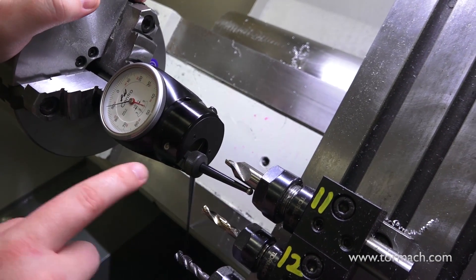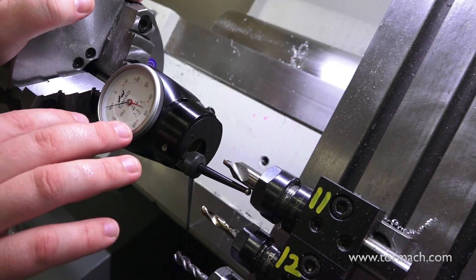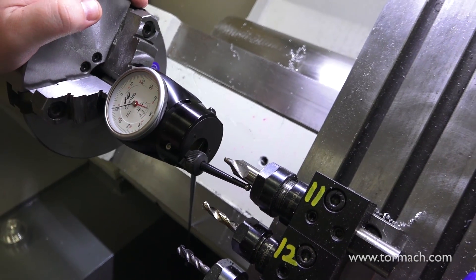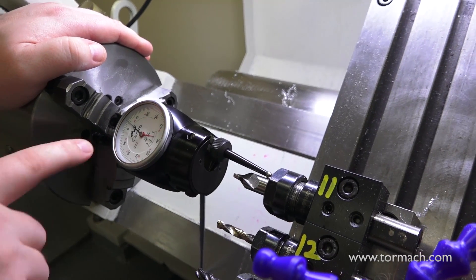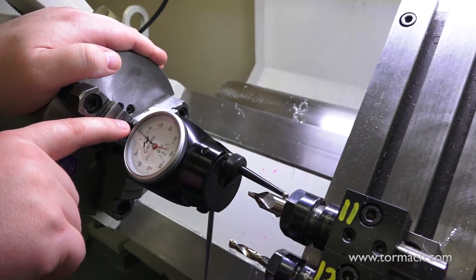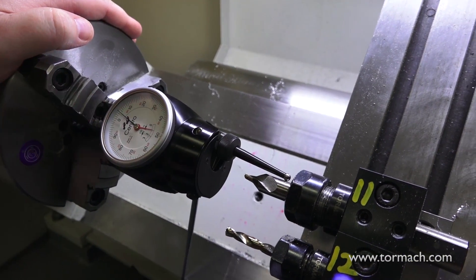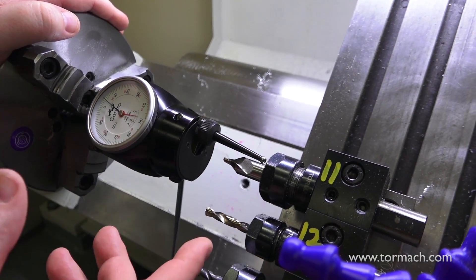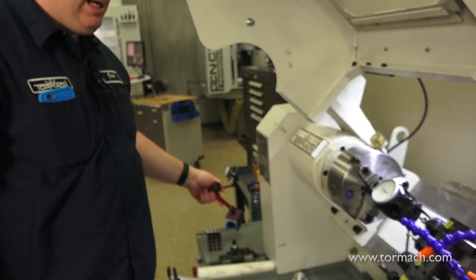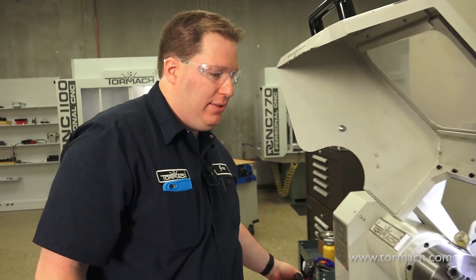As you can see, I'm on the bottom. This is in metric by the way — that is one difference, this is in metric, not inches. I am 10 microns — so 100 microns lower and 40 microns on the top. So I'm not actually centered. Using the mag base while it got me close isn't exact. So another advantage of the Centro is it's a more precise tool.